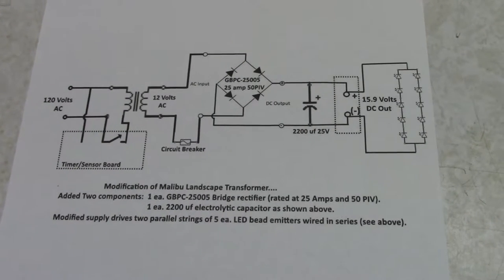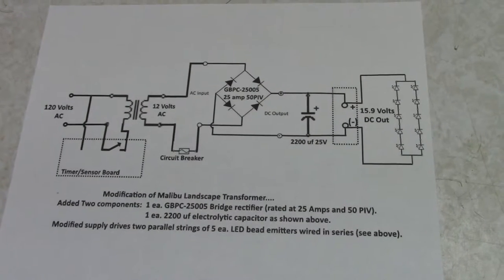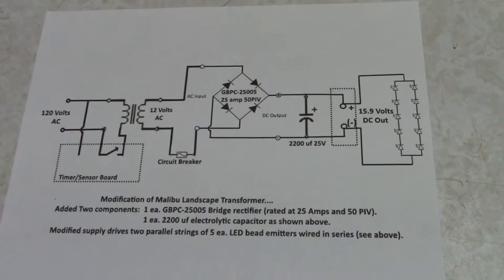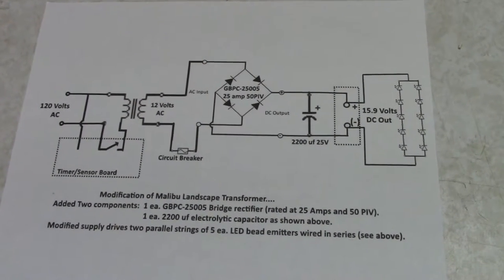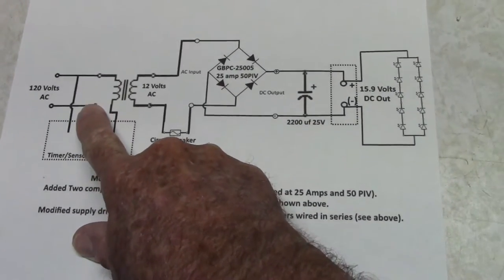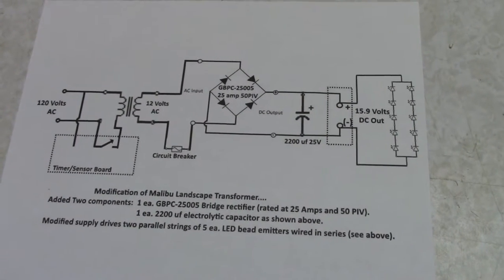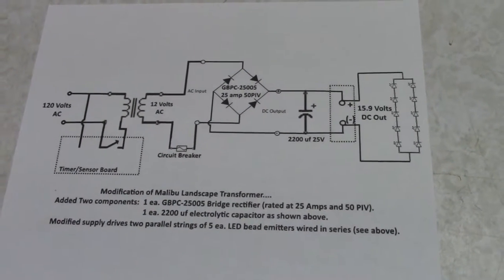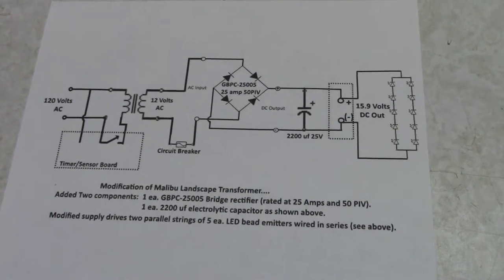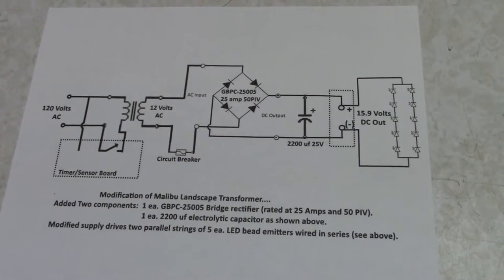Here's the schematic of my finished project. I thought I'd show you the overview before we got into some of the details on how I actually built it. But before we even get started, let's take a note of caution. This project deals with potentially lethal voltages, especially over here on this end — these are 120 volt AC coming into the Malibu unit. You're going to be in there working on this thing, so you have to know what you're doing. Keeping it unplugged is a good idea before you even open it up.